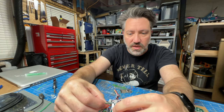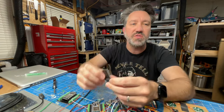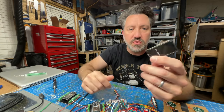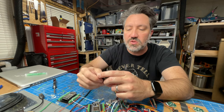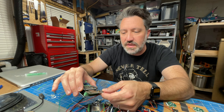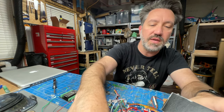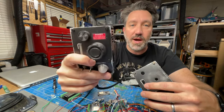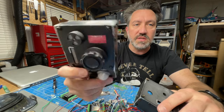My plan is to take this apart and transfer components over pin by pin to the new board. I've already flashed it via my computer using the Arduino IDE, confirmed that Wi-Fi works, the software loaded fine, and I can get in via Wi-Fi. As far as I can tell, this chip is completely compatible — it's labeled as an ESP-WROOM-32.